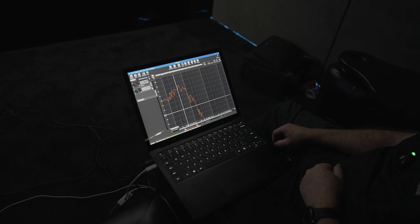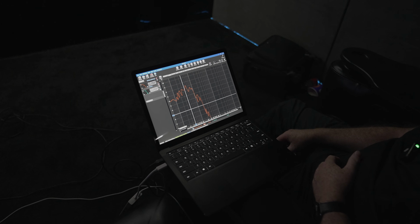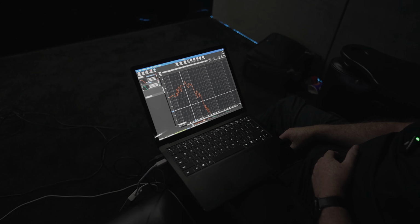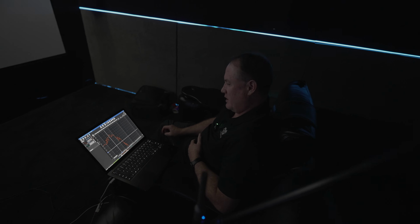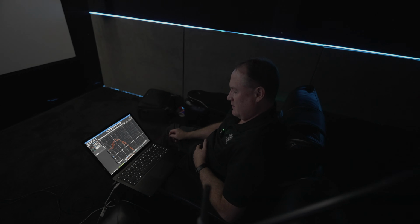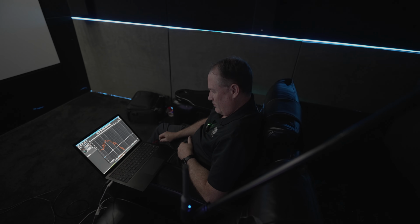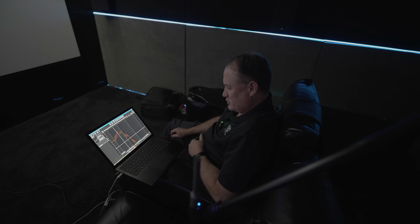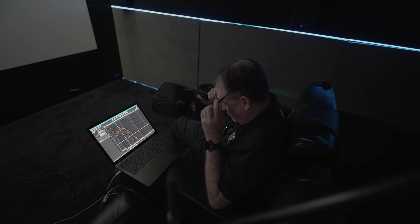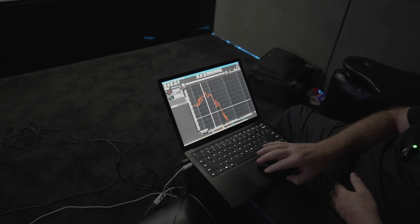and we're going to take a look at our first measurement pre-waveforming. So how's that looking right now with it off, Shane? It's a very respectable measurement. It looks like what you would expect from most processors, in terms of the overall plus or minus setting that you're getting in the frequency response. Going down, we have usable output really down to 5 hertz. So we're getting some pretty good response pre-waveforming.